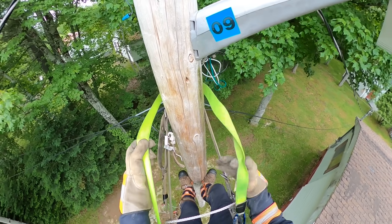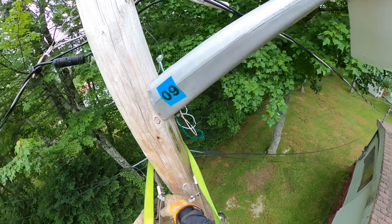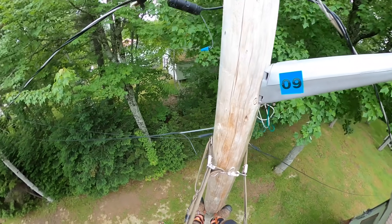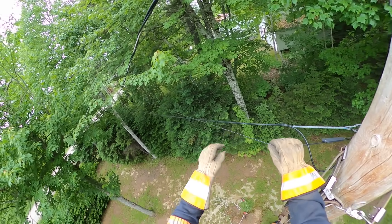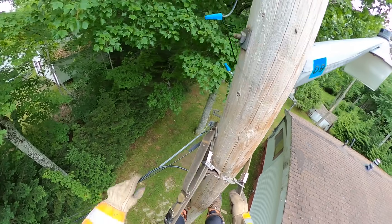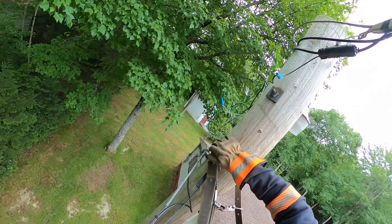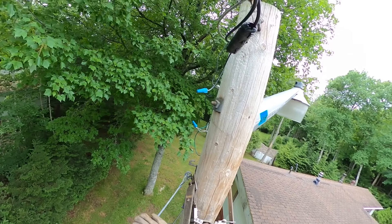Now we can set our weight back into the main belt. The cross strap isn't necessarily required here as I am belted over top of some lines. Most times when you're crossing over something, I don't want to rely on this little fiber coax line to hold me — but if you look on the other side of the pole, there are a couple of J-hooks that'll hold my weight no problem. So you want to make sure your second belt is actually over top of one of those J-hooks, because if you fall, the shock wave is more than enough to snap those tiny little wires.